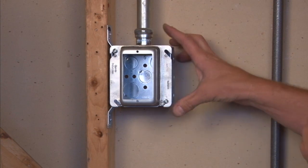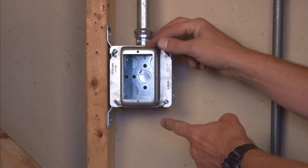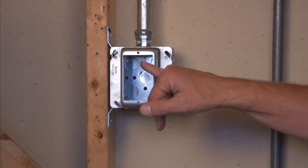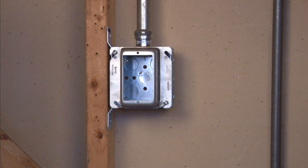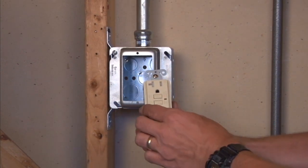As you can see, it mounts directly on. By tightening the box screws you get a nice secure fit of the ring. The depth off the wall is inch and a half and it comes with threaded 6-32 holes for standard switches, plugs and receptacles like a GFCI.